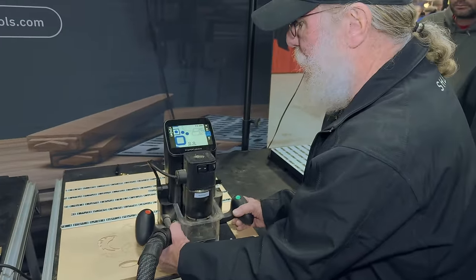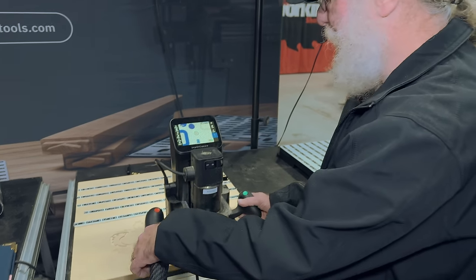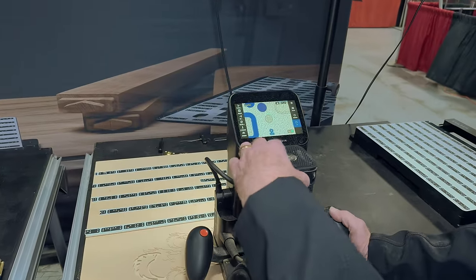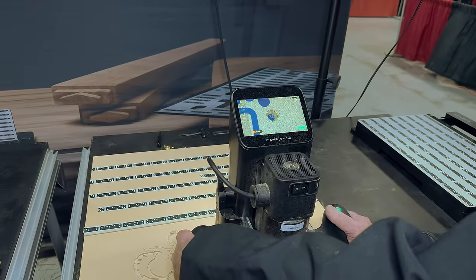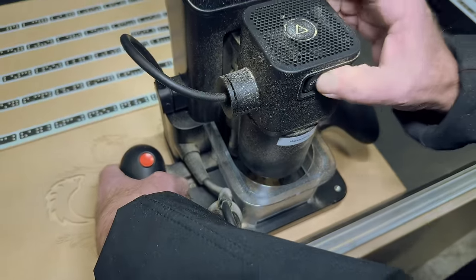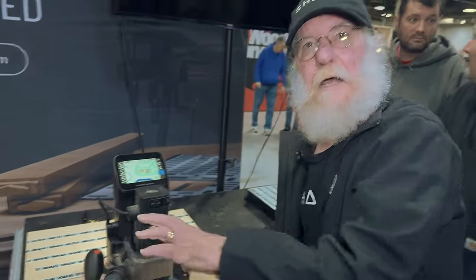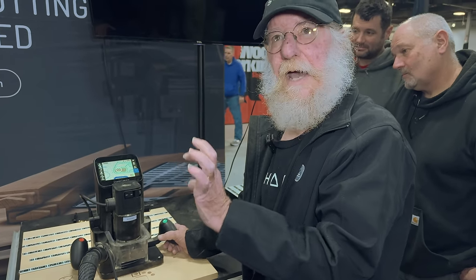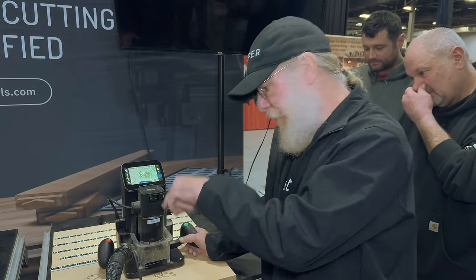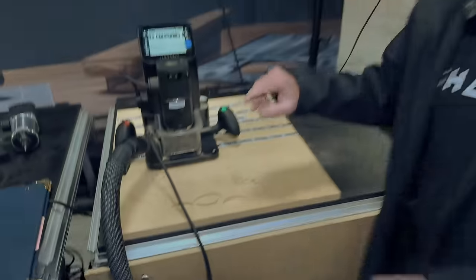I just copied that, so if I had multiple holes to do, I'd just tap into this. I'll go a quarter-inch deep. I don't have to be positioned exactly over the hole itself — I can be a little sloppy as far as that goes. I'm just holding the router still and letting it do its own work, and it keeps descending until it gets to the right depth. You have limited motion in what you're doing; the machine is actually doing the finer detailed motion. It has about a half-inch of travel, so you just get it close and let the machine do what it does best.